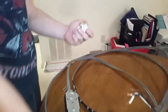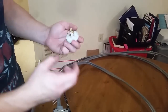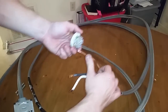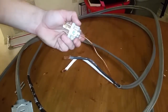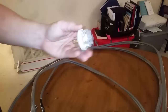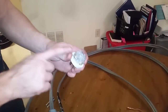This is a twist lock plug. This particular one is 20 amp because I have a 5k generator. There are bigger ones and they are not interchangeable, but they all work the same way. Again, the bare wire goes to the ground. This white wire, opposite of the ground, is marked with a W and is neutral because these are originally designed to split into two 110 volt legs and they need a neutral.